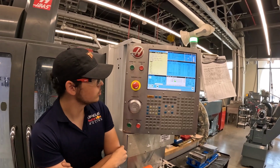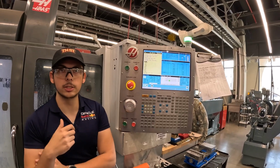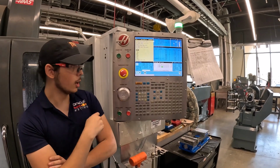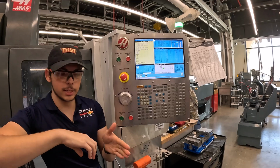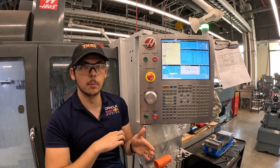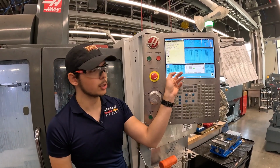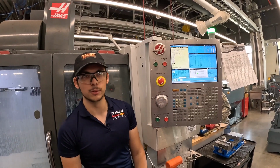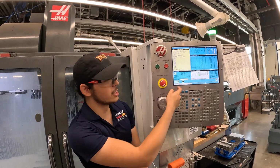The spindle load is like force on the spindle or something, or what is it? Yeah, it's the load on the actual spindle motor. Oh, like resistance that it's getting? Yeah, because that cutter is basically pushing into that metal, and there's going to be some forces coming back that the motor is fighting against. It usually doesn't go very high unless you're cutting, maybe, titanium. You might see that go up to 40% or something. But aluminum, even steel, it's going to be pretty low.